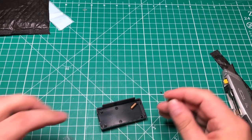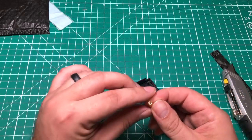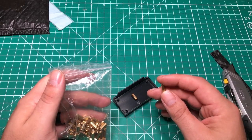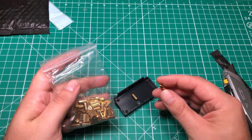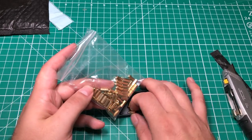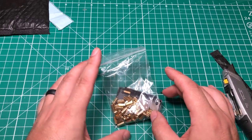I don't have a full unit, but I did a previous video — these look like they're a little shorter. No, they're the right ones. I did a previous video about the RGB to HDMI adapter, and essentially it's a Raspberry Pi Zero with a shield on top of it. You really do kind of need these little spacers to stand the Raspberry Pi off — or more specifically the RGB-to-HDMI off from the Raspberry Pi. These are perfect for that. I had very few of them and I've got at least five RGB-to-HDMI's to put together. These things are actually kind of hard to come by — there's a lot that have a male thread on one side and female on another, but to find these in any quantity at all, female-to-female, 10 millimeter, 12 millimeter, something like that, is really hard. I was happy to find these — I think I paid a little bit more than I wanted to, maybe five or six bucks, but it's an important safety thing to make sure my boards are properly stood off.